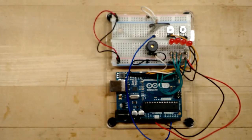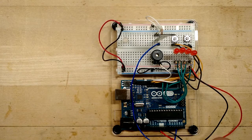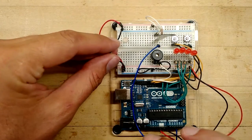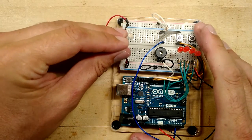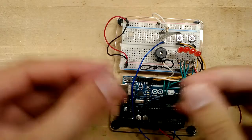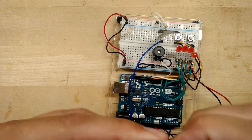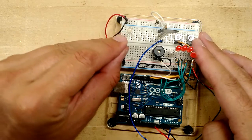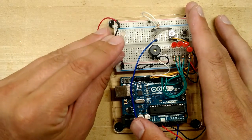Now, just like with the red LEDs, the red, green, and blue LEDs in here each need to have their own resistor. So again, we're going to use a green, blue, brown resistor, a 560 ohm resistor. And for each of the non-ground pins, we're going to wire 1 resistor to sort of jump over the break, like this. Let's see if I can get that in. Okay, we're going to keep trying to wire this in. Sometimes with the new breadboard, these pins can be a little finicky.